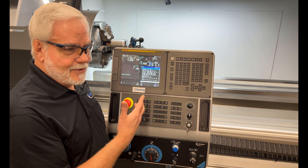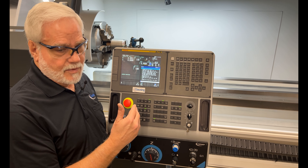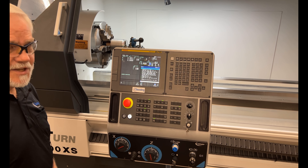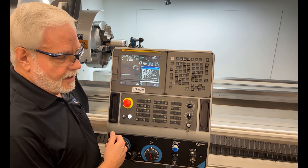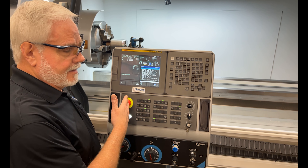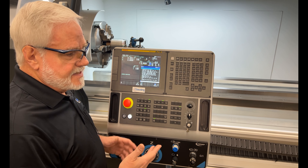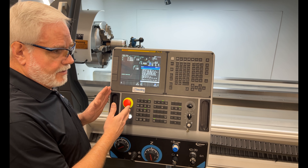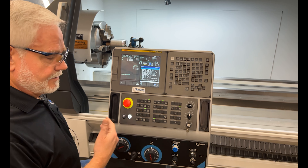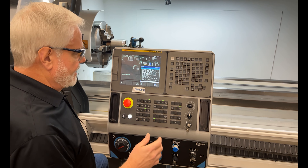Before we do the work shift, one thing I want to emphasize is that we have to select a master tool — the tool that's going to be used to set part zero all the time. In continuation of developing the tool offsets, after getting the work shift set, we're going to turn the OD to get the X offset. Whatever tool we used to set the work shift is our master tool; it's the one that finds part zero. So I'm going to take that same tool and now calibrate the X offset with it.